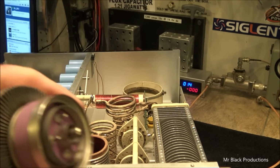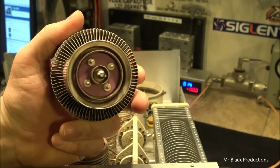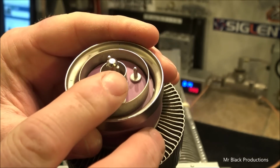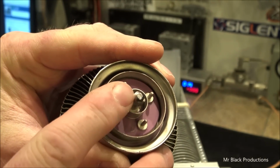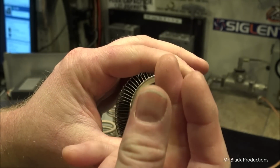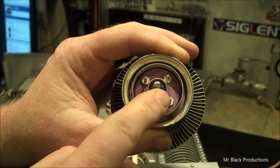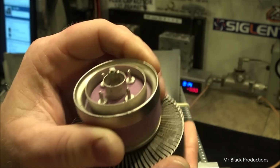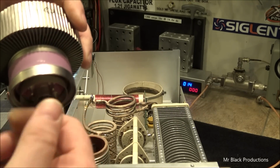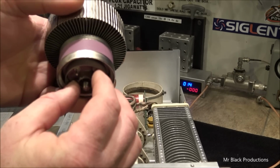When this thing came in here, somebody had twisted the tube to try and pull it out. And there's a little set pin, the indexing pin here, that does not run all the way to the top of this lug. The way the Russians make the socket for this, it's got 2 fingers with a ring at the top, and that ring slipped around this pin. Well, there's a brass pop rivet at the bottom that allows this indexing pin to spin. So there's nothing that keeps this tube from rotating other than the sheer tension against the other legs.